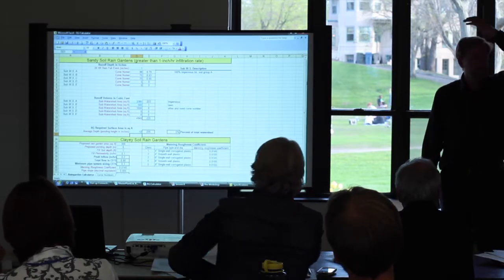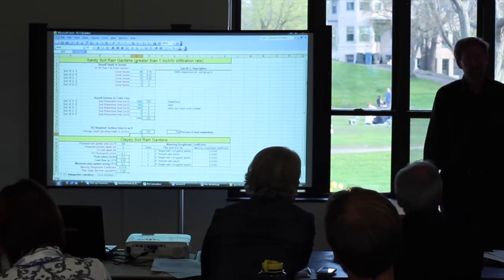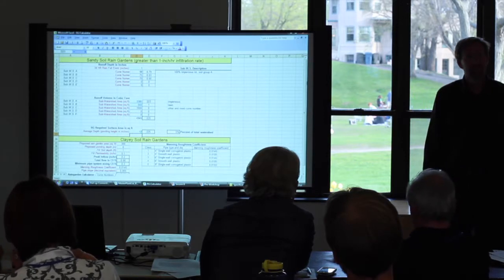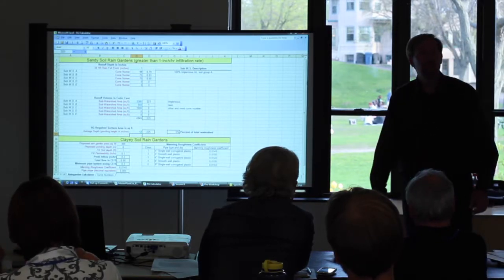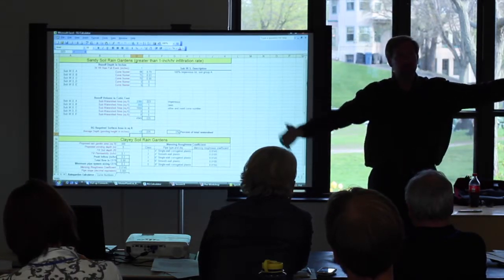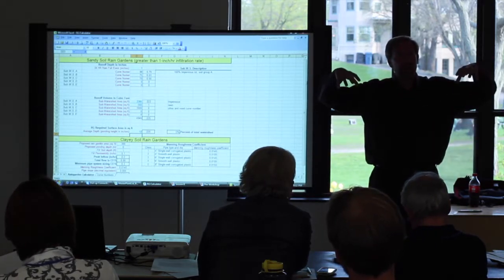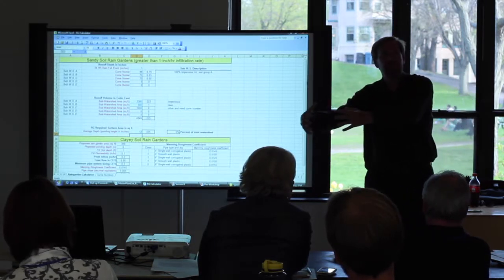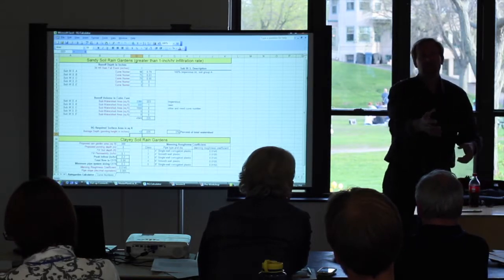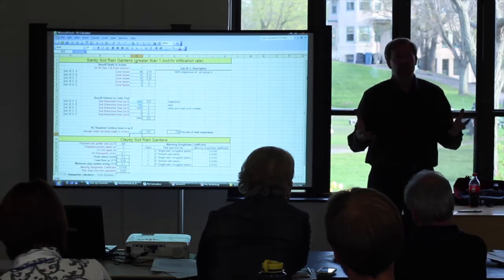Well, I guess to me, the other point is whether you start at some point. Again, I'm looking at two properties side by side, which is a total acre, which is probably part of the issue. But whether again you start looking at sub-districts. Oh, absolutely. If you're making one rain garden for 2 acres of property, you're going to get a very large rain garden. If you look at breaking that up, that a half acre goes here, a quarter acre goes here, a half acre goes here, it still might be all that same square footage, but all the individual rain gardens are going to be much smaller.